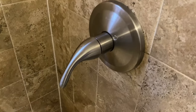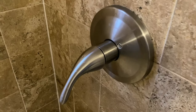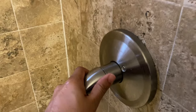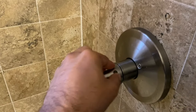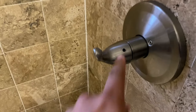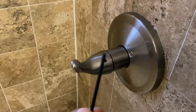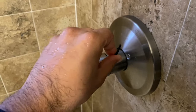Now if you are a responsible adult, you could go ahead and turn off the water — but who needs to go all the way down to the basement? Turn the knob. You'll see a little hole over here; it's a little plastic or rubber plug. You take that out, and in there you will need the right size allen key.